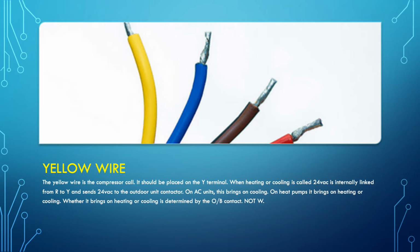Heating is dictated by the O/B contact. In most brands, the reversing valve is energized for cooling, so when it's not energized, it's naturally in the heating state. Rheem is not like that. Rheem is naturally in the cooling position with the reversing valve, and in order to bring on heating, you have to energize the B contact. Now, on most thermostats, O and B are the same terminal contact. And we'll talk about which wire that is throughout the slides here. There's a slide specifically covering that.